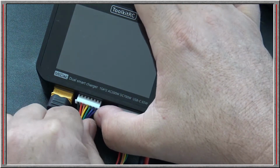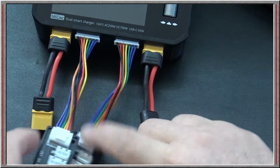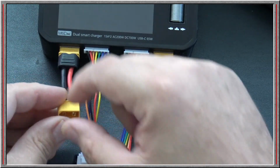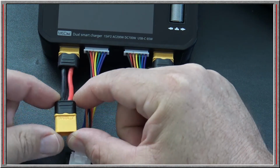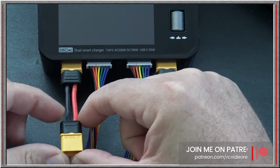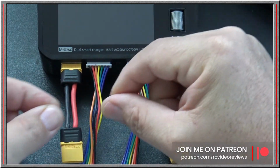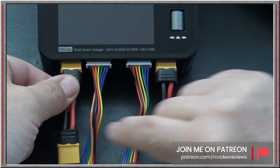If you need to get some of these things, if you don't have them, I've got the balance extension boards in the description. I've got the XT60 with the sheathing. By the way, I'm switching to these. I really kind of like these. These sheaths click on really easy. You don't have to heat shrink. They provide separation and they don't pull off. So when you're pulling your XT60s apart, you're not constantly fighting with heat shrink that wants to separate. So I'm switching to these.